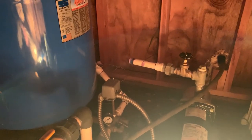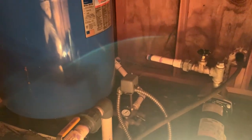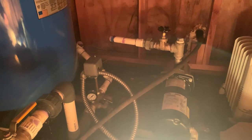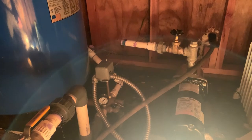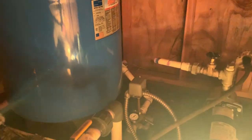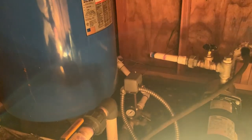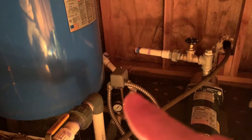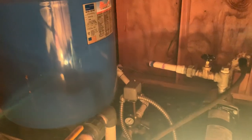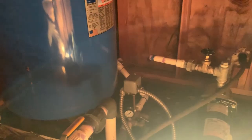The reason why I'm making this video is not because I think this is a particularly interesting problem, but the problems I ran into along the way. To understand those, it might be good to explain a little bit about how this system works. Behind this wall we have our pond, and here is our pump. It runs on 220 — I think it's a one and a half horsepower pump with a double impeller. Whenever it turns on, it pumps water out into this pressure tank. The pressure tank has a pressure-triggered switch — that gray box there — which will turn the pump on if the pressure is below the top limit of 100 psi. If the pressure drops below the bottom limit of 80 psi, the entire system turns off.